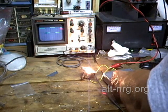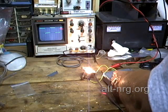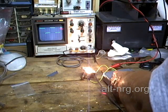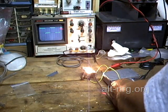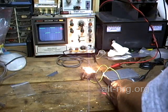If I bring it back up and just leave it at the point where it stabilizes, then whatever that current is, that will be the maximum. And if I attempt to change the load, it will again roll back the duty cycle.